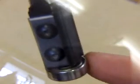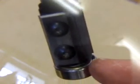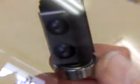So what does that mean then? That means that anywhere this bearing follows, whether it be a straight edge or a curved edge, the blade will cut here to exactly the same shape. So we can run the bottom on a template here, we can have our workpiece rough cut on the top, and what will happen is the blade will trim the workpiece exactly to the shape of the template. Clever stuff, eh?